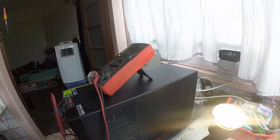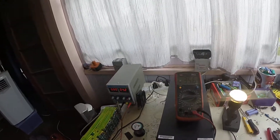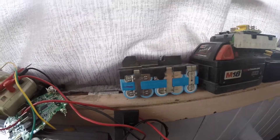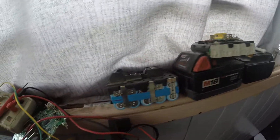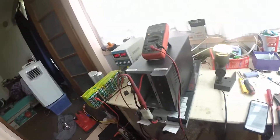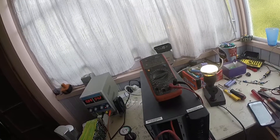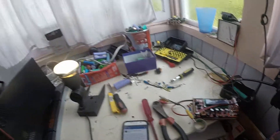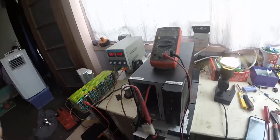So we will build two 5S lithium battery packs — essentially two of these, like these 18 volt Milwaukee batteries. We'll build a couple of those up and see if we can't get at least 10 amp hour. If we get 10 amp hour, we've got more than what this had, and better voltage with a higher discharge rate. That'll also allow me to charge them back up with a LiPo charger so I can keep them balanced, and I don't have to worry quite so much about the cells being perfectly the same.